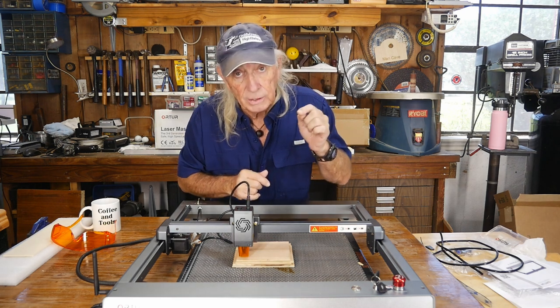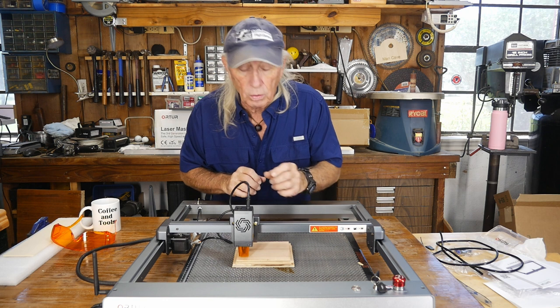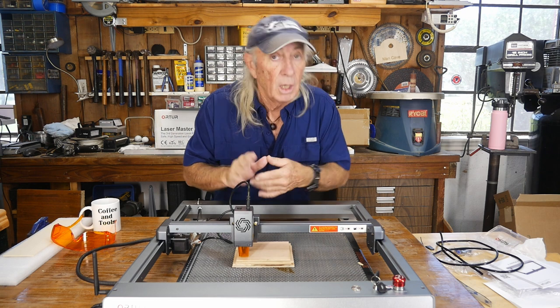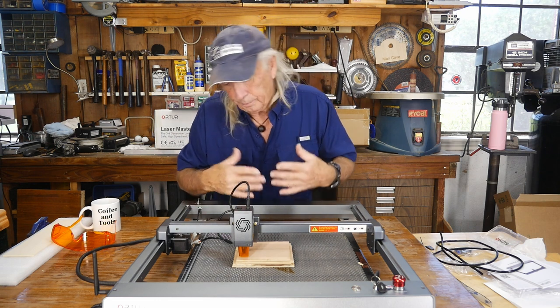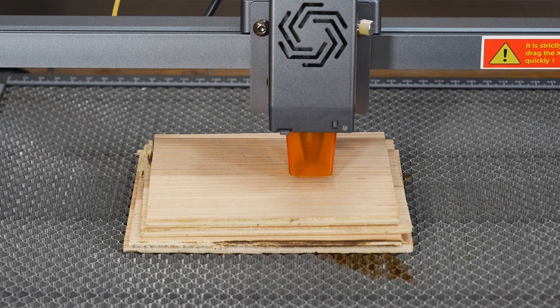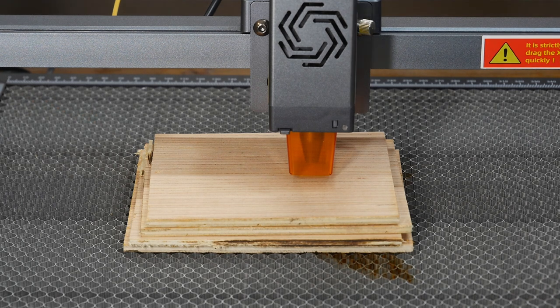We're going to do this without adjusting the laser head and then see how deep it actually cuts through. I'm going to crank it up to 100% power, slow the speed right down so it goes real slow in a circle. Then we'll pull the plywood layers up and look through them to see exactly what happened at each point. I've cranked the speed way down, laser at 100% power, and I'm going to do five passes in total to really try to cut down through as much as we can. Let me get my goggles on and then we'll start cutting.